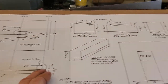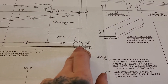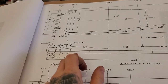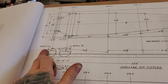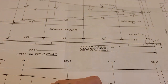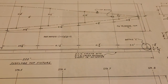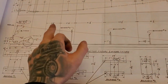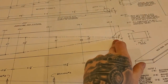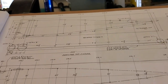There's this detail — this one has a bit of a taper and goes under the tail post longeron, but it doesn't really tell you if it gets bent at one of the stations. It bends at station three and angles up, but further back I don't know if you just let the tubing sag and touch wherever. That doesn't really make sense to me, because if you let it sag without inducing a bend, when you remove the structure it'll just relax and go flat again. I can't figure it out — I understand the block for the lower section while welding in the top, but the block for the upper section I don't understand.